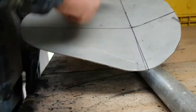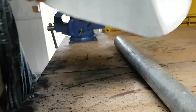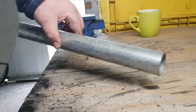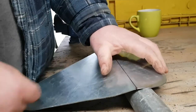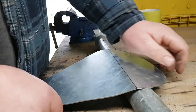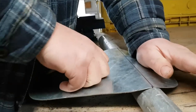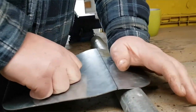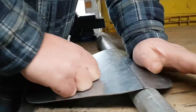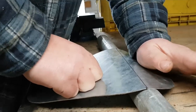So as you can see I've marked all the way across where I want the bend to start. I've already started rolling. I've got a metal bar here, just rested it on. I've drawn a line across the back as well where I know where I want the bend to go. So all I'm doing is pushing down on both sides and just rolling the bar, just keep pushing — that's all I do, push down.